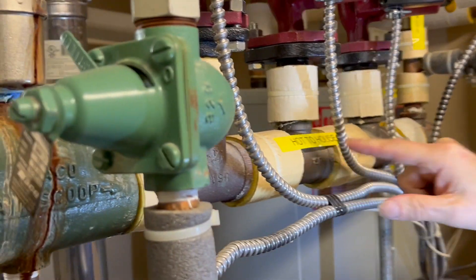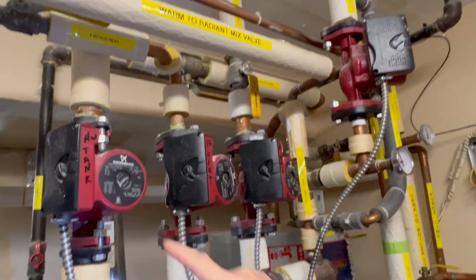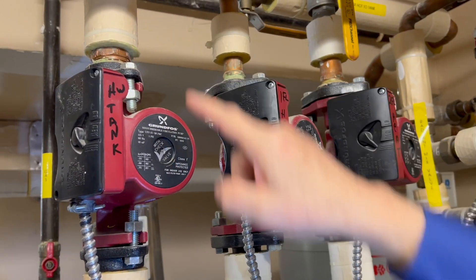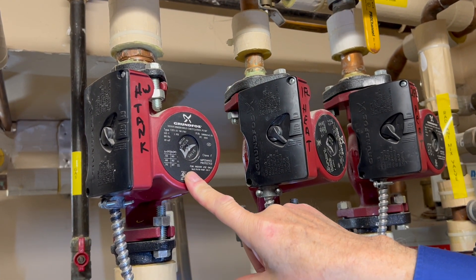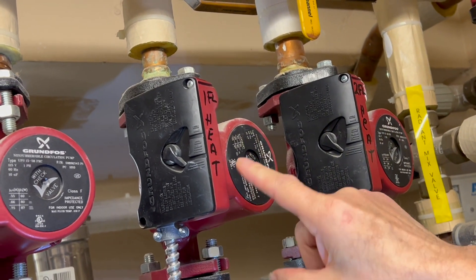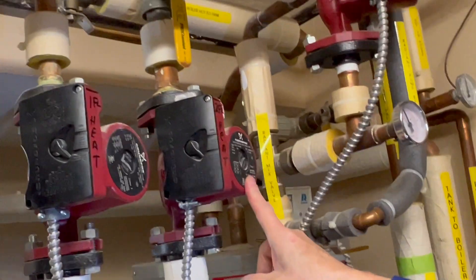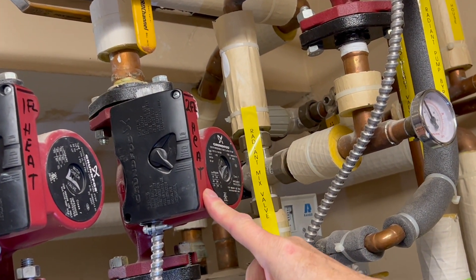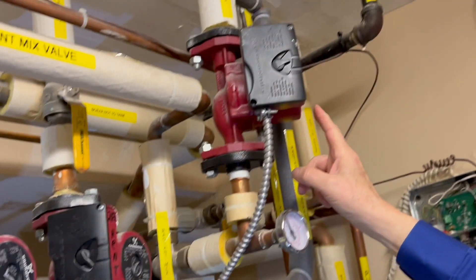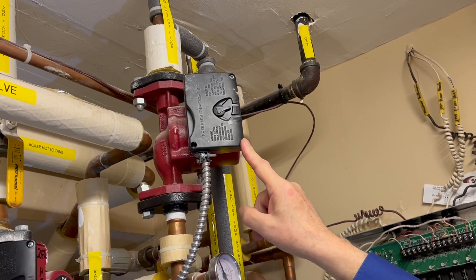Hot water goes to the house, and then we have four little water pumps. This water pump is going to the hot water tank over there — this is what fills the outside of the water tank with hot water at 190 degrees. This mini water pump is sending hot water to the first floor heater in the back of this room. This water pump is sending hot water upstairs to the second floor heat, which is the radiator blower mechanism up in the attic. And this tiny water pump is labeled 'radiant,' which sends warm water to the heated floor in the master bathroom.